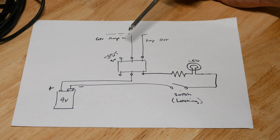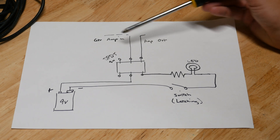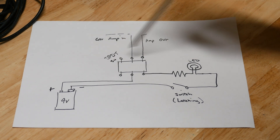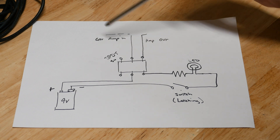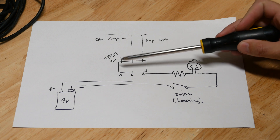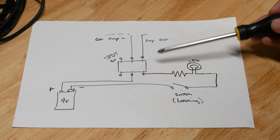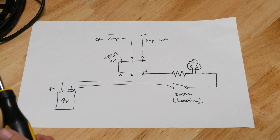If we design a circuit to do what we want, we're going to replace the current single pole double throw switch with a double pole double throw switch. Right now it's a single pole — it can go one of two throws but it's only one side. If we change it to a DPDT switch we can have another circuit on the other side that we can latch on and off. We could put a nine volt inside that box.